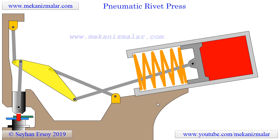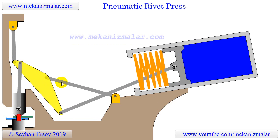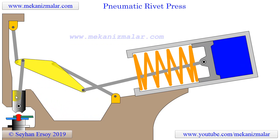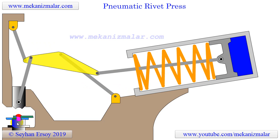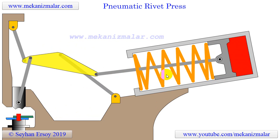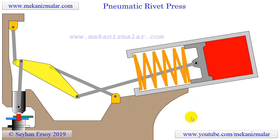How does it work? The central element of the linkage is the main link, shown in yellow. There are four simple links that attach to the main link to guide its motion. The silver-black tool that forms the rivet head is at the lower left, moving vertically in the brown frame. During the cycle, the tool bears down on the anvil that supports the rivet in order to expand the shank as a second head. The inclined piston moves to the right and upward because of the spring force as air is bled out of the cylinder, causing the tool to rise and opening a space to accept the rivet that is to be driven.